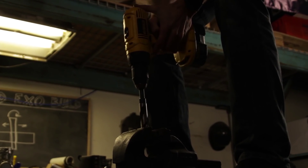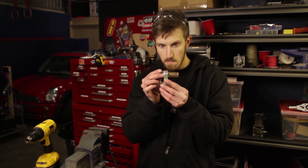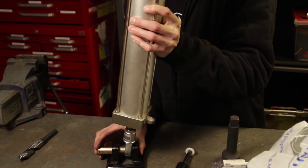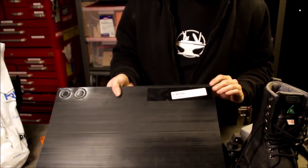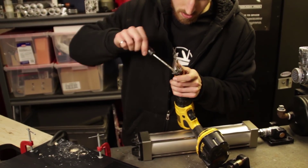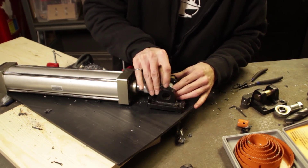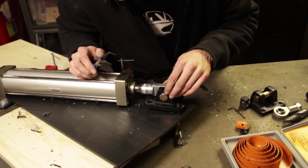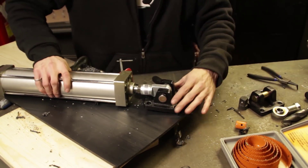That's going to be bad. Time for the moment of truth. So as you can see we've got a bit of slop left to right, so we're going to need some spacers in there. We might as well just make those out of some plastic — I've got some scrap UHMW here, and we're just going to use a hole saw to make ourselves our very own washers. The problem with split rings is they wear out pretty quick — you're not really supposed to take them on and off all the time; it's more of a service-once-or-twice thing. But as you can see, now we have some spacers.